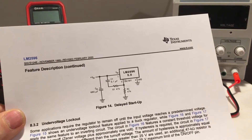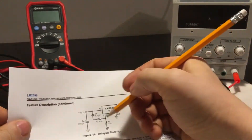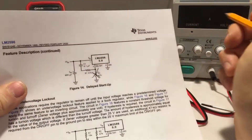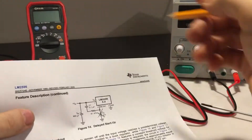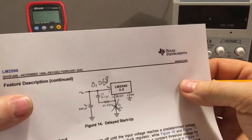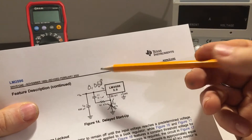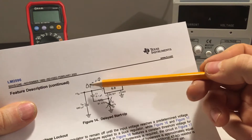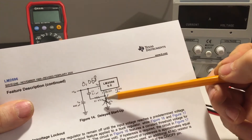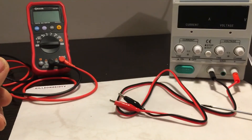I didn't want this. What I found out is: if I remove that capacitor completely and instead of 0.1 microfarads I used 0.068 microfarads — a really tiny capacitor — it actually charges really fast for some reason, but it creates the necessary delay.